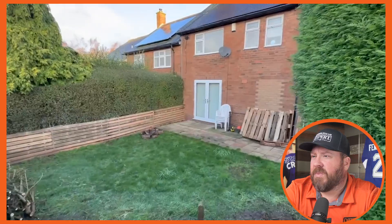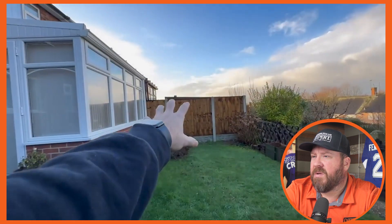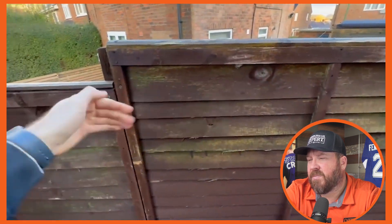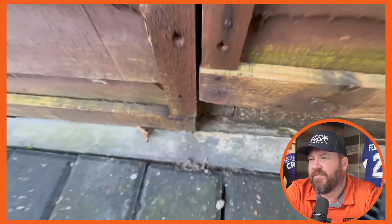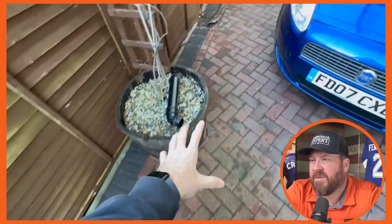In this case, it is a concrete board at the bottom that these panels sit on top of. So it gives them a separation layer between the ground — the aerobic zone that typically causes rot — and the wooden fence panel, thus extending the life of the panel. So obviously we're going taller, so fencing is going to be around six foot from ground level. We don't want this driveway moving.